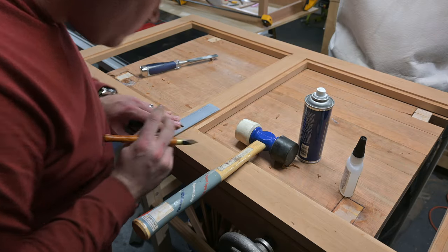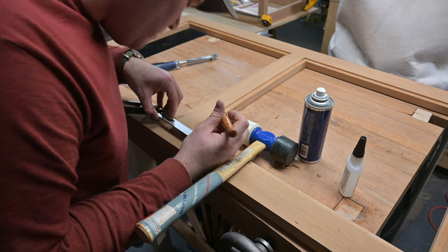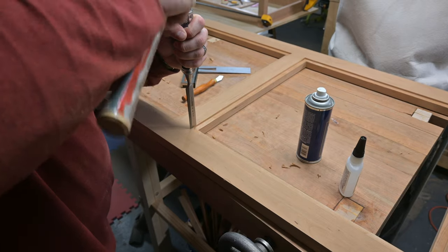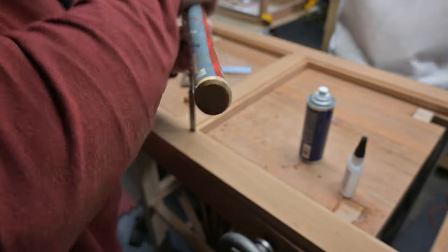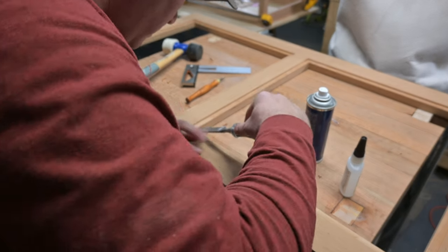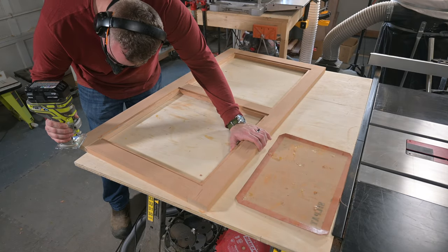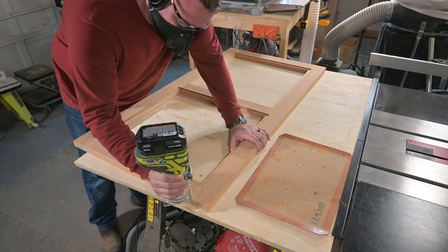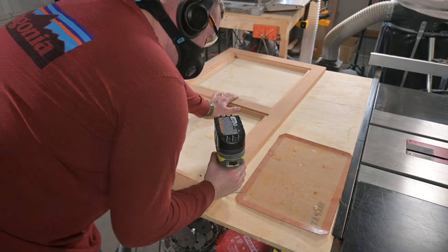After using a rabbeting bit in my palm router to allow the two glass panels to inlay into the tabletop flush, an operation I clearly failed to hit record before doing, I squared the corners with a chisel carefully to avoid chipping the coffee table top. Once the recesses were completed, I used the palm router to put a light chamfer on the top of the tabletop, and a much deeper chamfer achieved through multiple passes on the bottom of the tabletop. This is probably my favorite tabletop edge profile right now.